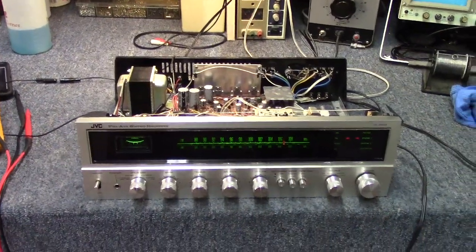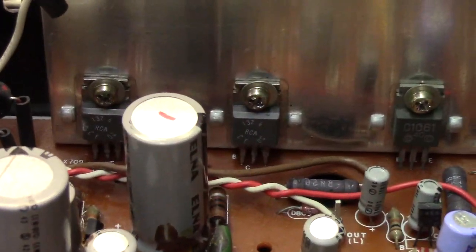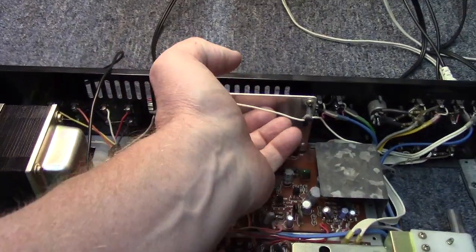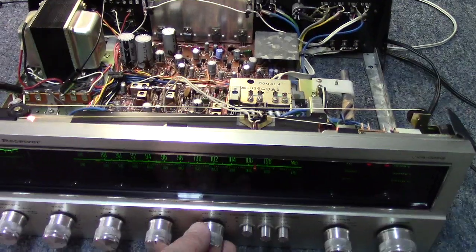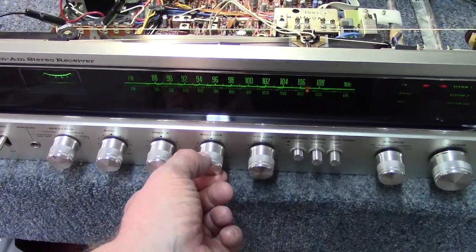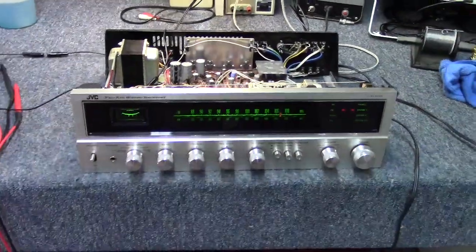All right, picking back up with you, I went ahead and got those RCA outputs installed on the one shorted channel there. And I'm picking up with you about an hour after I've done this. I've had it running pretty much the whole time. Heatsink is not even warm, and I've had it bumped up a few times. Both channels absolutely identical in sound.